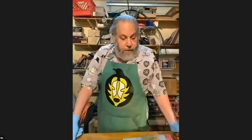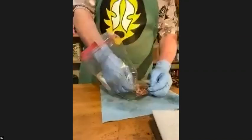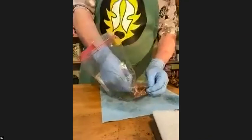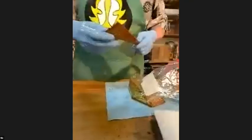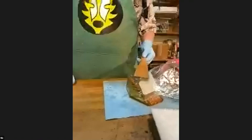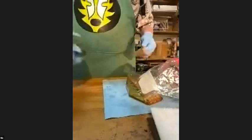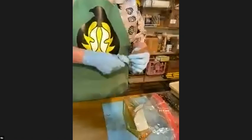The oldest and simplest finish is drying oils. Most nut oils are drying oils; vegetable oils are non-drying; petroleum products are non-drying. For finishing we use drying oils. Here's a good example — these are little spatulas I make. I put them in a bag with boiled linseed oil, squeeze all the air out, and let them sit for 10 minutes to a couple of days. Then simply wipe it all off.